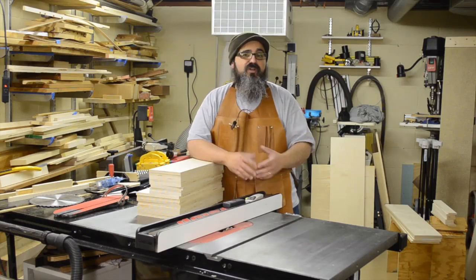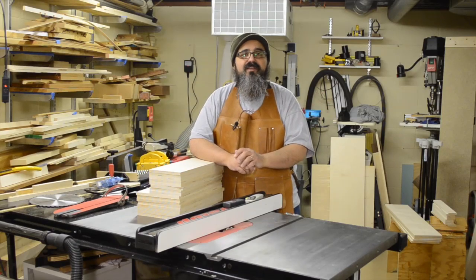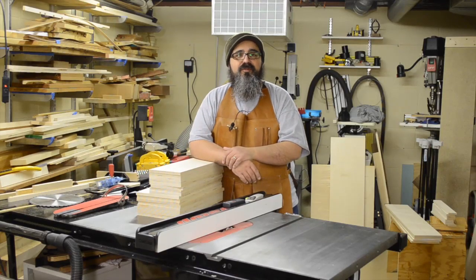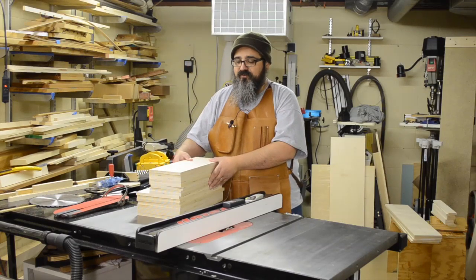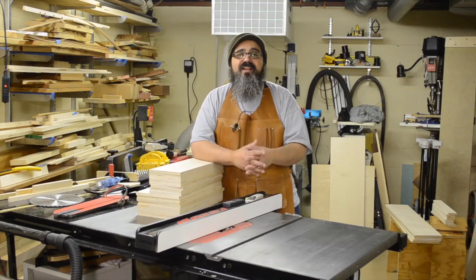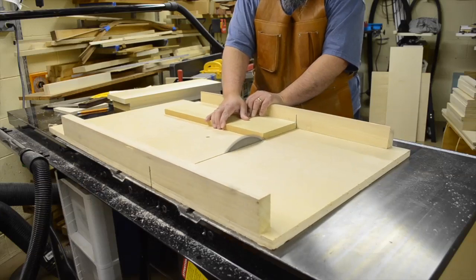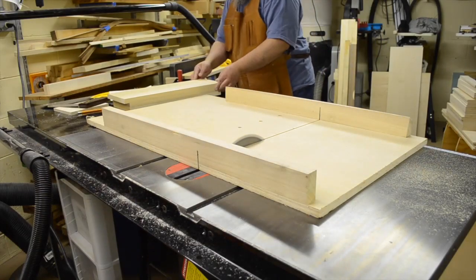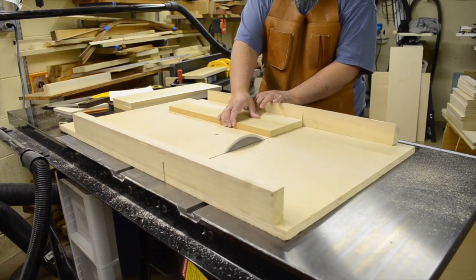Anytime we're using plywood or solid wood, we have to plan how the pieces are going to go together. It only takes a few minutes — you can sketch it out on paper or use something like SketchUp to help plan your cuts. Once you do that, it's really easy to get things taken care of. Now that we have all our pieces ripped and cross-cut to the dimensions we need, it's time to turn our attention to the drawer fronts. We've already got these mostly set up — we just need to cross-cut them to the desired lengths, then rip them to the desired widths.